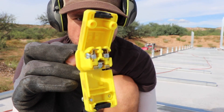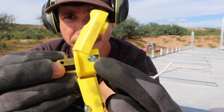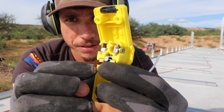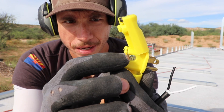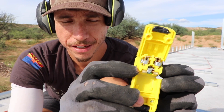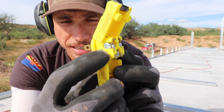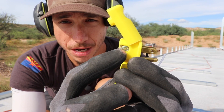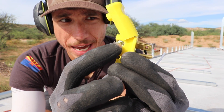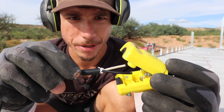When we open up the plug, we can see there are two screws — one on this side and another on the other side. To know which wire goes where: on one side there's a silver screw, and that's your neutral. On the other side there's a brass screw, and that's where your hot goes — the black wire.